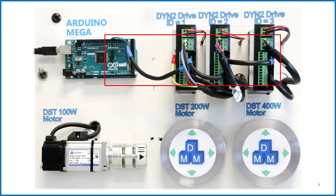When the DYN servo drive receives data from the RX, it checks the drive ID. If it doesn't match, it forwards data out the TX, sending it to the second drive. Be careful with communication timing and delays when the data travels through each drive.